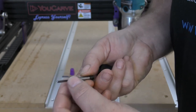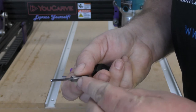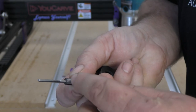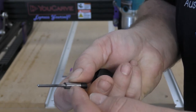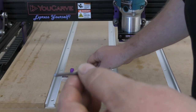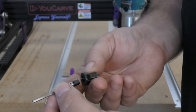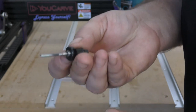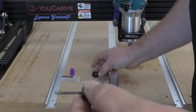The silver side is where we're going to be inserting our end mill. When you insert it, make sure that you don't put the cutting flute inside the adapter — always make sure you're only ever grabbing the actual shank itself. Now that we've done that, we're going to grab the collet that goes inside the router and sleeve that onto the back like this. That's now pretty much ready to insert into the Makita router.